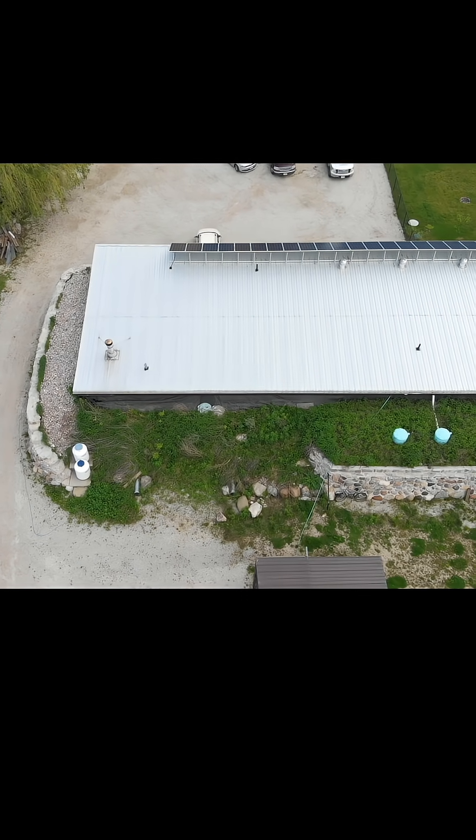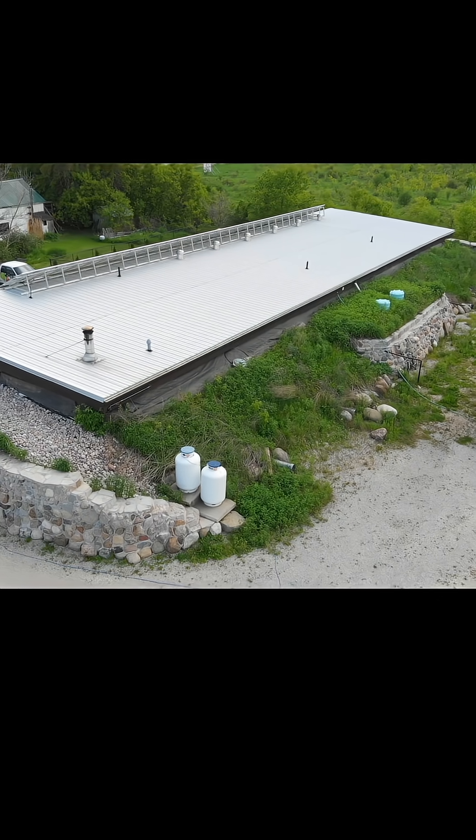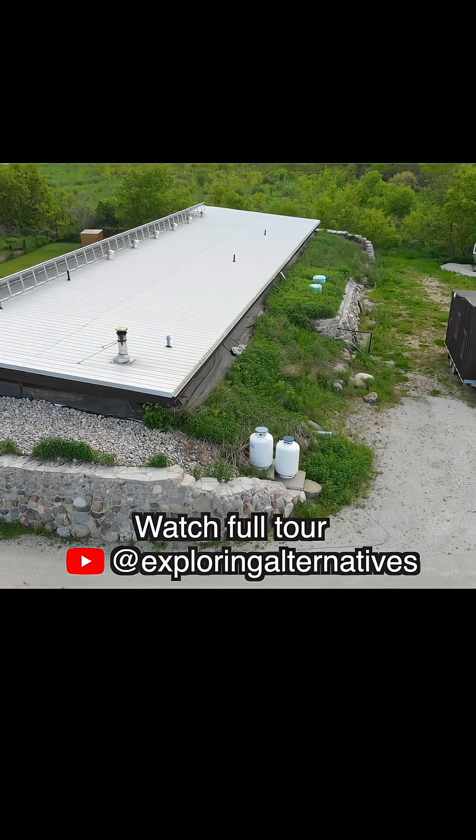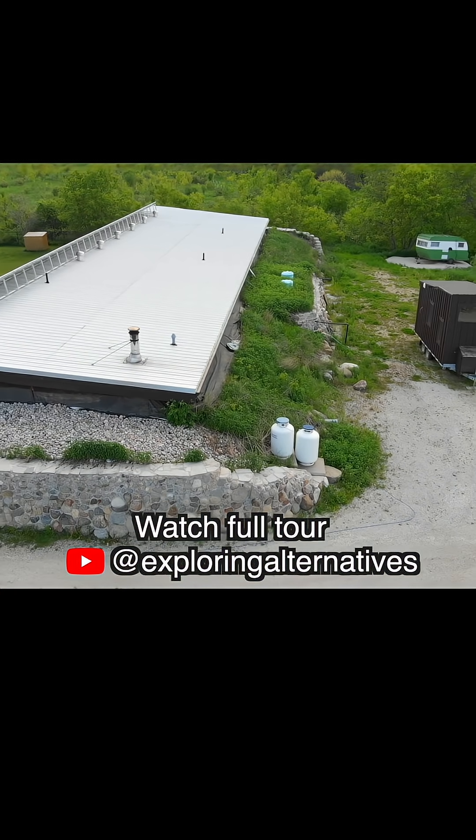And as the air passes through the earth it helps to cool it as well through those 15 feet of earth. These ones I've set up are totally passive — the air just gets drawn in through that stack effect and goes through on its own.